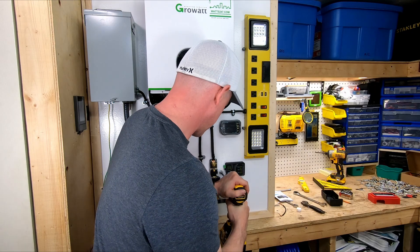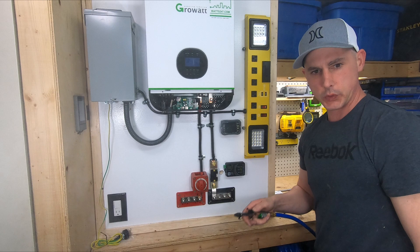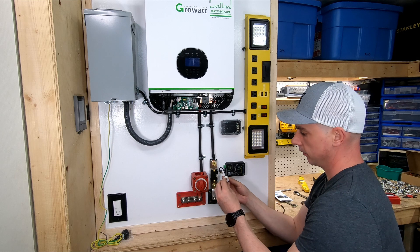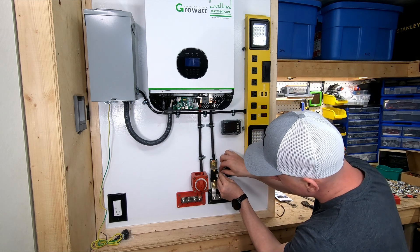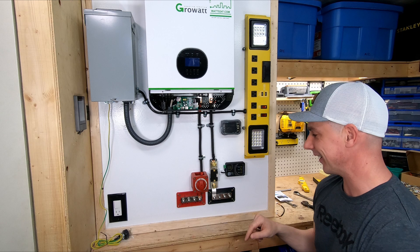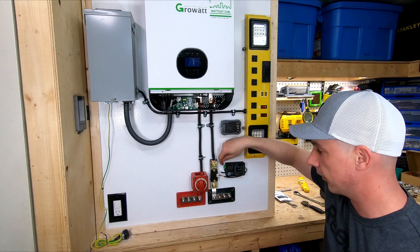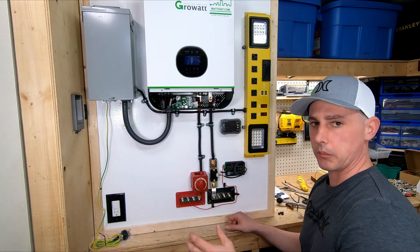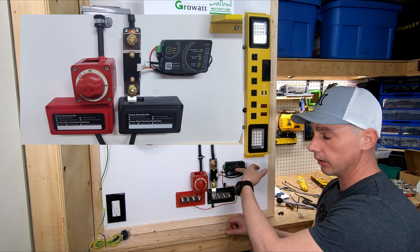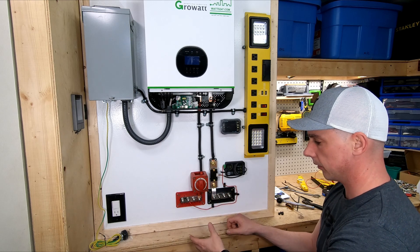The lower one is for the display interface, so I drilled for the lower one. I got my cord running through the back, popped it in the hole — that looks pretty good, I like it. So I've got my screen connected. Now I need to run a positive wire from here over to the bus bar. I'm almost at the finish line — I'm going to find a better way to run this positive wire for the shunt; this is just going to be temporary for now. These clips aren't working out the way I'd hoped, so I'll come up with a better design for that.